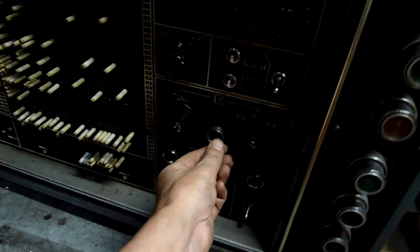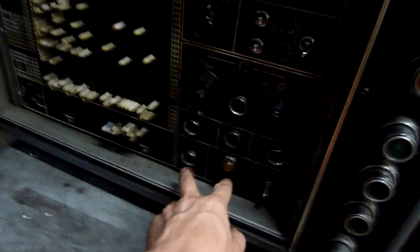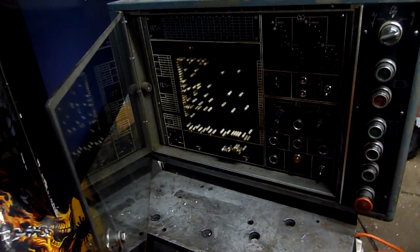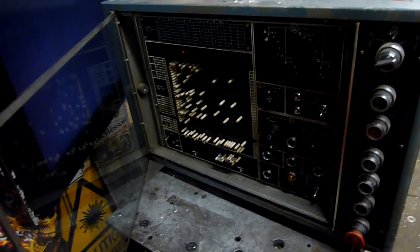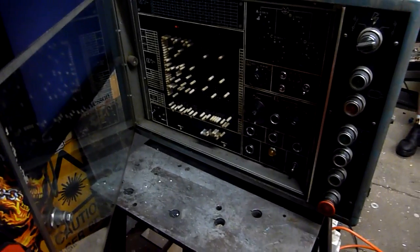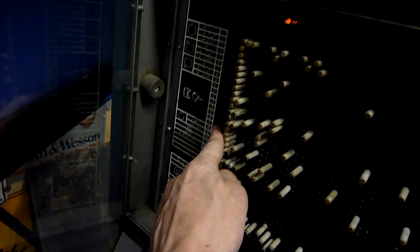That's your spindle speed, spindle stop, start, spindle counterclockwise, clockwise. You've got your other stuff like coolant pump on and off, but the top and bottom are your X and Y axis. There's no Z axis, but it's basically a turret lathe which is automated by pegboard control rather than any kind of real digital computer. So you've got tool back, tool in, rotate the post — that's the turret — and that's your tool. Forward-facing tool for facing, rear tool for parting off or grooving. Then that's your spindle speed and the tables up here for the various speeds.